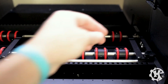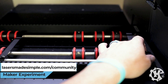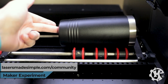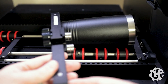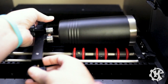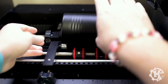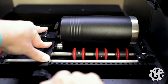When it comes to the rotary, we have these black pieces that you can stick up and slide along — these are your stops. Near the front I'm going to place the stop that I will place the rim of the cup against. You can see over here it can just move freely; I don't have anything holding it in place. That is where this bar comes in. You'll see the holes along the edge and there are pins in this bracket that align with the holes in that frame, so you want to make sure that you fit into the hole and then tighten it down.